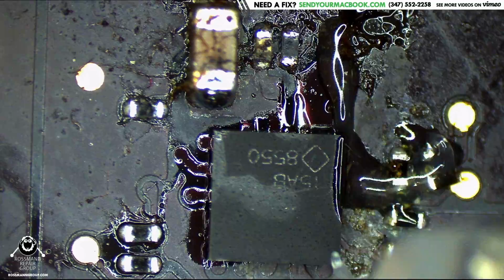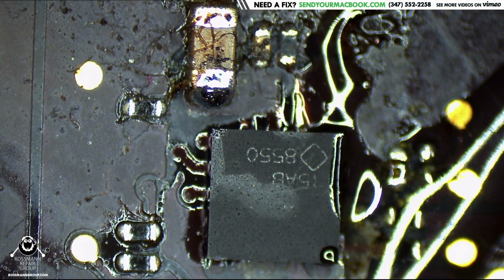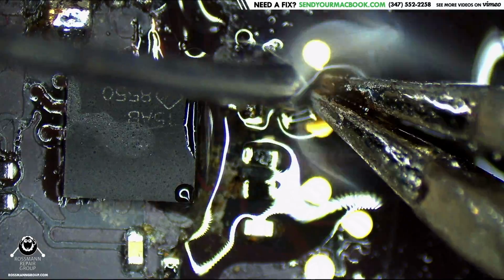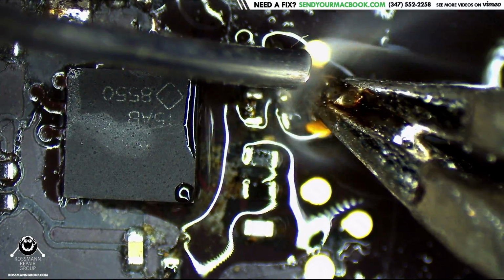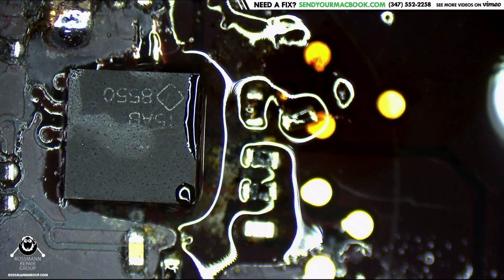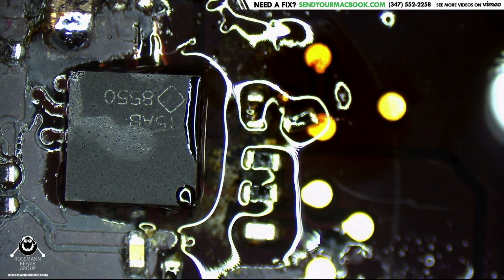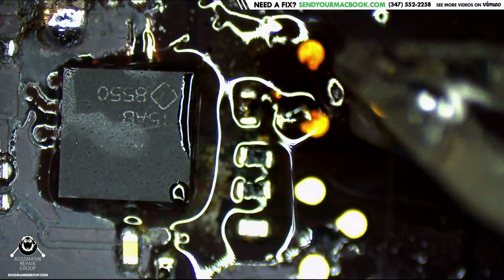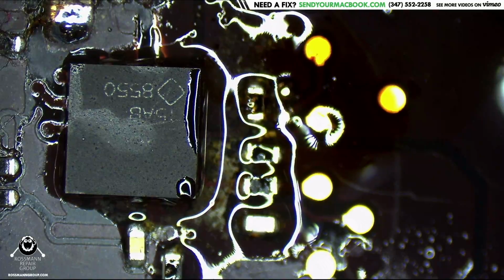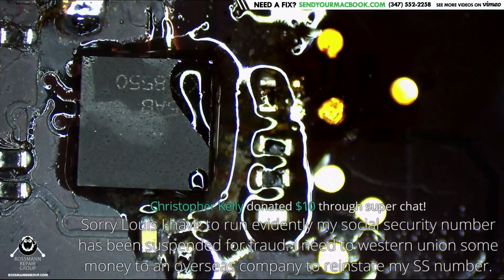All right, so back here, I'm just going to make sure that that little resistor feels appreciated. Also the ends of the pad. Another, but I'm not really happy with that resistor actually. You can go. GTFO. That's likely going to cause it to come back for warranty. We'll take a different resistor.